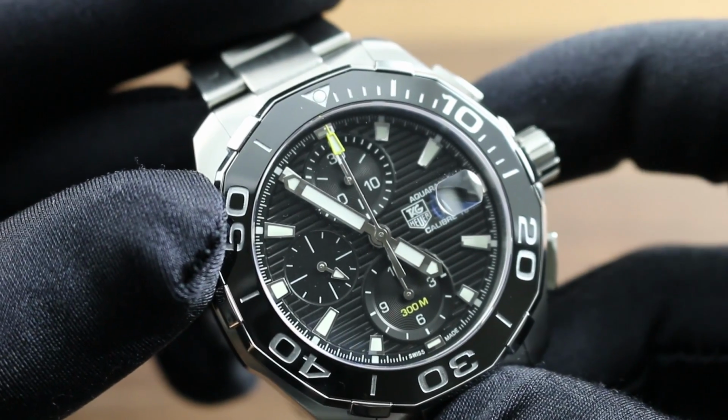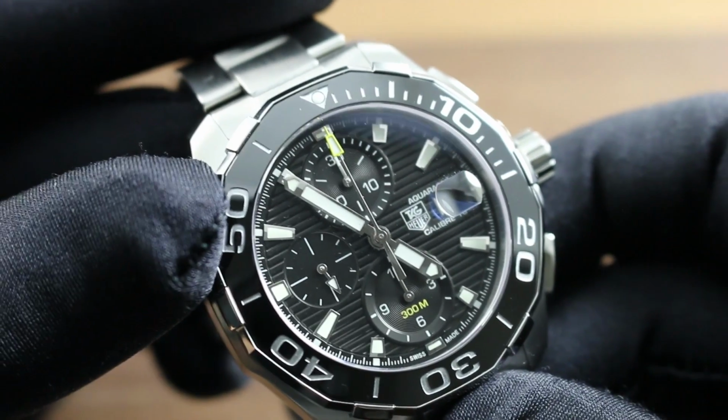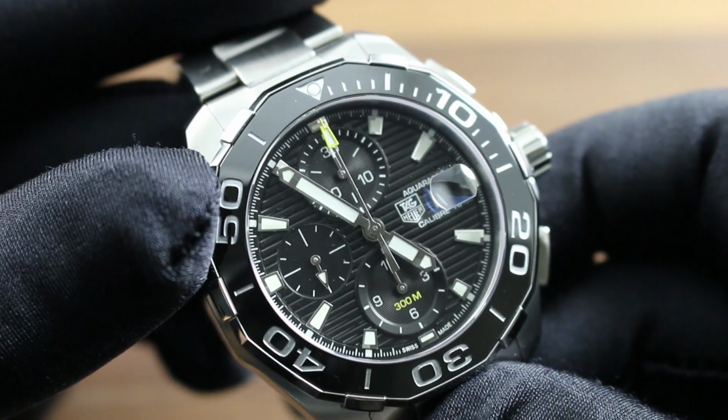If in doubt, wind the watch more, as you cannot overwind this automatic winding timepiece. The bridle-style mainspring will simply slip and relieve excess stress.